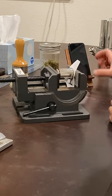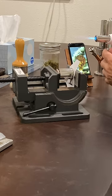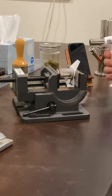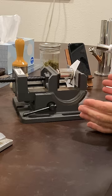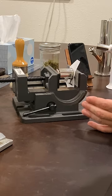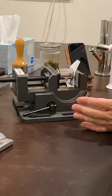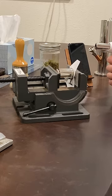Number one, turn your flame down, which is what I'm going to do. Just like that. There we go. Turn the flame down just a tiny bit. Or I could heat for less time. I could have done that too. I could have just kept the torch where it was, and instead of heating for 2:05 like I did, heat for 1:45. Either one of those would have worked. I decided to turn the heat down, my flame down just a tad.